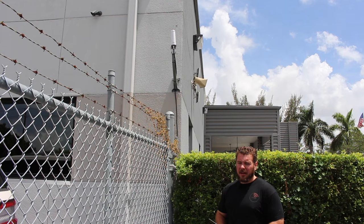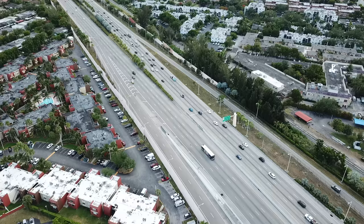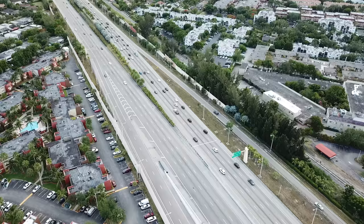Again, this is different from Wi-Fi. Here we are at the outside antenna. I've got an omnidirectional antenna that's 360 degrees. Sometimes you can get away with using a 360-degree antenna even though it has much lower gain or forward-reaching potential, because we are in an urban environment.